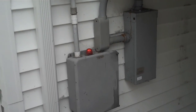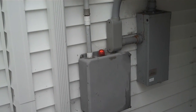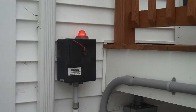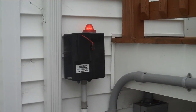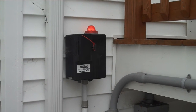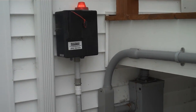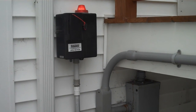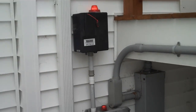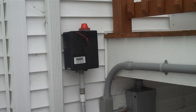When you do this test, you'd actually be able to tell whether your main alarm is working, and in your case you'd be able to test whether your battery backup system is still working. Now why aren't the lights going out? It's probably just a timing thing because of the amount of water that we put in — your tub could have held a little bit more than normal. It'll pump approximately 10 gallons per minute, but you have an older pump and your pump might actually be pumping at a lower rate — like 5 gallons per minute. To pump out the extra 20 gallons, that could take 2 minutes at 10 GPM, but 4 minutes at 5 GPM. It went off at 7:30, so it was probably running for about 2 to 3 minutes.